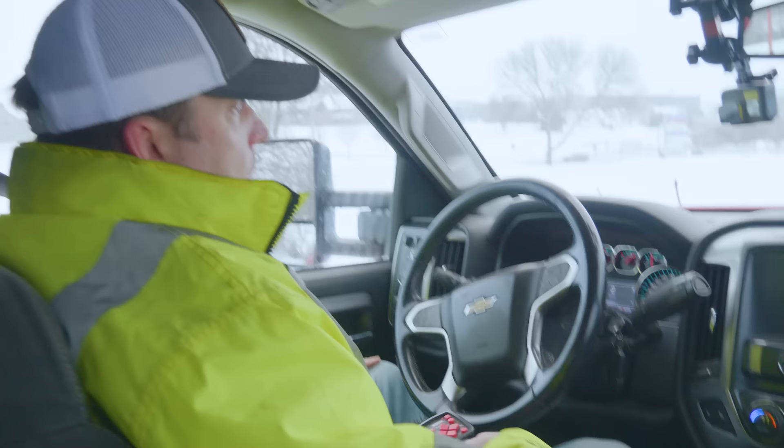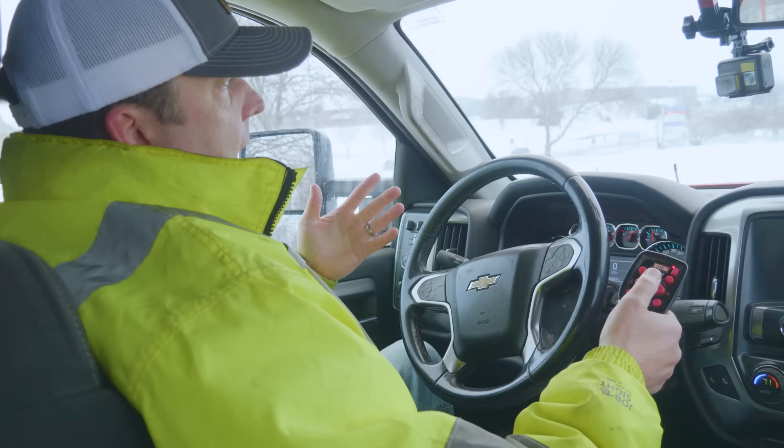Now let's say I did a couple of those — I'm going to keep pushing the windrows to that left side. One of the other things in having your plan is understanding your winds. Today we're actually having a lot of wind. So use that to your advantage — right now the winds are actually blowing to the right. It's a little counterproductive what I'm doing because I'm plowing to the left and it's going to keep blowing back over. In an ideal world, try and coordinate so that wind is going the same direction. It doesn't work out all the time because I'm actually trying to pull snow away from the center islands here. At the end of this, I had some spillover — in an ideal world you don't want that, but when you have a lot of snow like we have out here, you're going to have that.